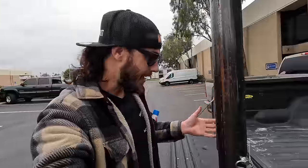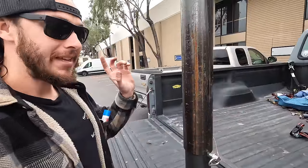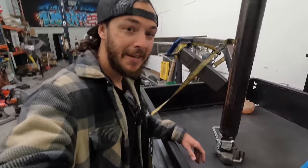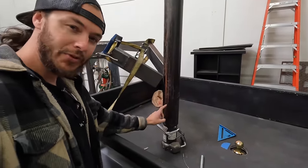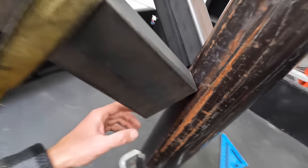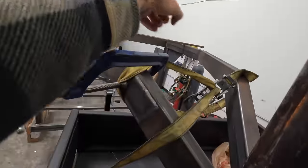We have to manufacture our own outer tube. From what I've seen, you drill the pin hole all the way through, and there are also two holes up top with welded-on nuts where bolts tighten down to take any slop out. I don't have a good way to drill through quarter-inch steel, so we're going over to Dave's — he's got a mag drill and annular cutters. The outer tube is much too tall right now; we'll cut it to size. We also need a compound radius cut where this coupler sits into the trailer frame — a 14-degree compound radius cut has to happen there.